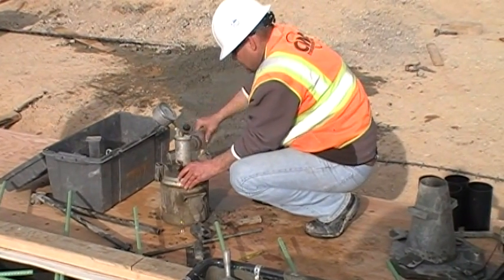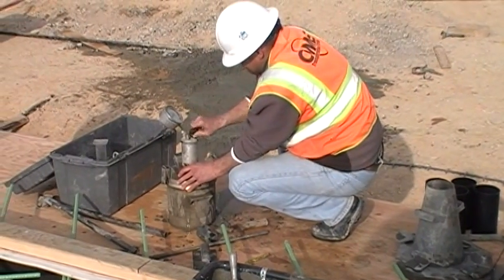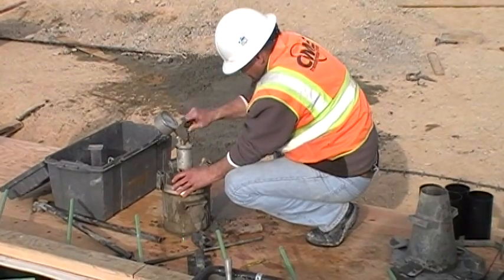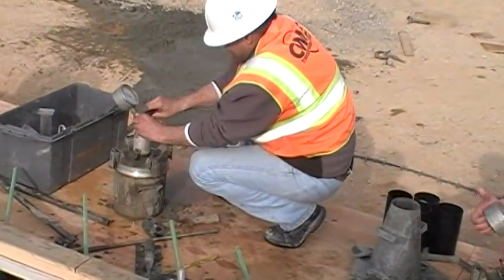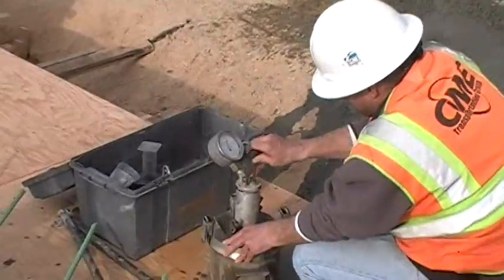Pump the gauge to the initial pressure, or IP, that is identified on the gauge. Close the petcocks. Depress the lever and tap the bowl smartly with a rubber mallet at the same time. Tap the dial to settle the needle, and then read the air content to the nearest 0.1%.